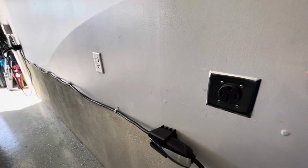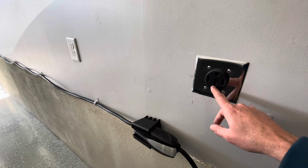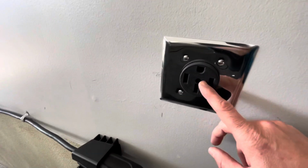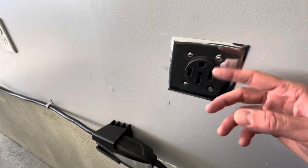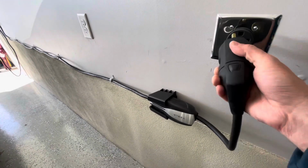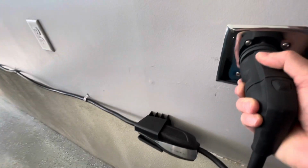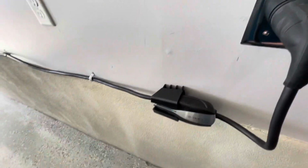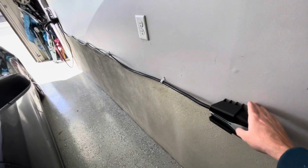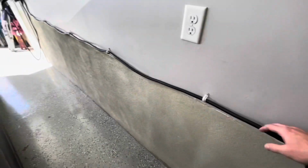So you basically tell them you need a 240 volt, 50 amp outlet. This is the standard outlet. This is like a dryer outlet that they would put in. So your Tesla mobile charger will come with this plug, and basically you just plug into this. Okay, you plug that into there, and then you can use this mobile charger. All cars should come with this. If you're buying a used one, make sure it's coming with the used cable here.